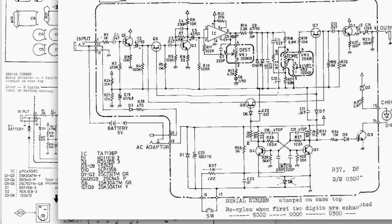The DS-1 — again, we're going to go through a buffer, like basically every Boss pedal does. Past the switching, because this little JFET here is just a switch. Whenever the pedal is off, it basically routes the sound to the other buffer. Whenever the pedal's on, it doesn't let the clean signal pass through that, forcing the sound to go into the first stage of the DS-1 after the buffer, which is a transistor boost stage.